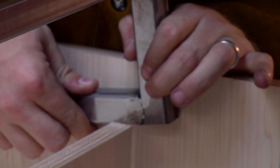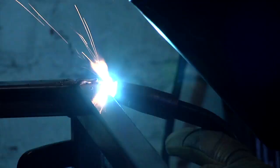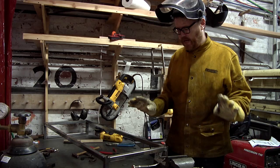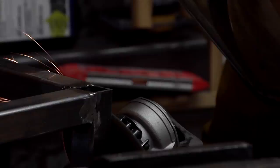Is it in or do I need to sand a little bit down here? There we go. I broke loose on that end — that's not good. Okay, this is good enough though. I'm going to take it back and weld it. So I built the top frame of the desk. It's as square as I think I'm capable of making it. I've got it all welded. The welds aren't pretty — I am fully aware of that — but they look clean. They don't have oxidation and I look like I've gotten good penetration between the two pieces. I feel confident that they're going to hold together.